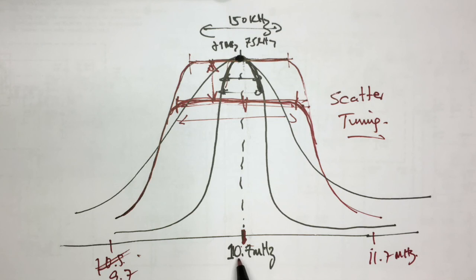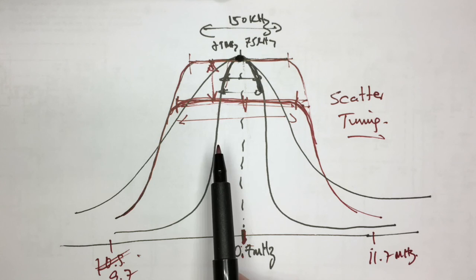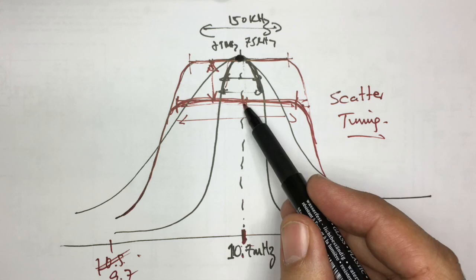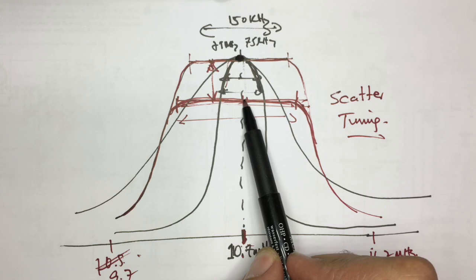And the way I'm going to do that is, again, I'll show you with the signal generator and the scope. And we'll see what happens here. I'll show you what I've got, and I'll show you the effect of changing any of those cores. What sort of effect they will have on the shape and on the gain, okay? Now, one thing to bear in mind is I am not certain how responsive the whole thing is, because, after all, you're measuring a voltage across an electrolytic capacitor. Now, you've got a capacitor sitting over there.